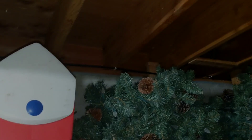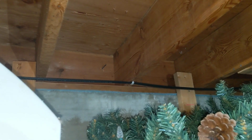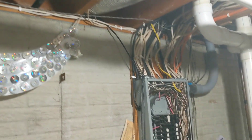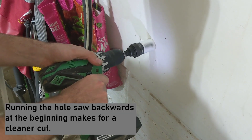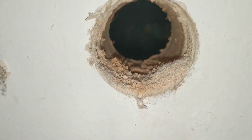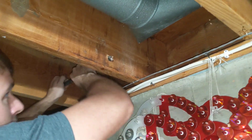The pilot bit has come through the sill plate, so we're going to take off from there across the joist and get over to the panel. We got our hole drilled and we're through to the other side, so we'll go inside and start running some cable.